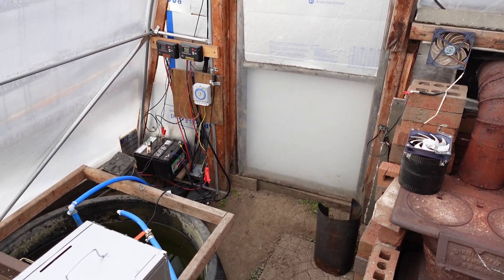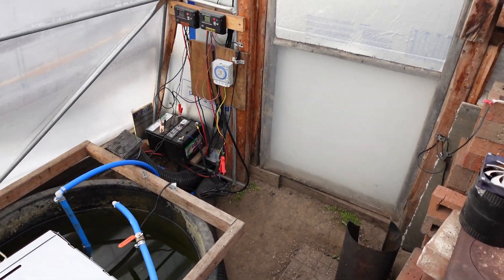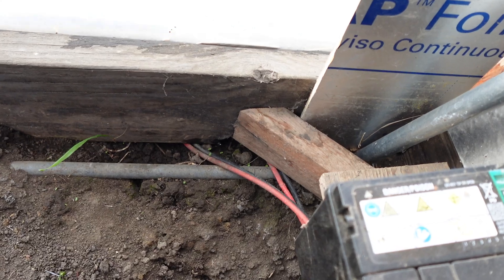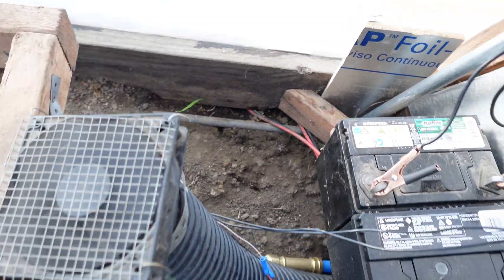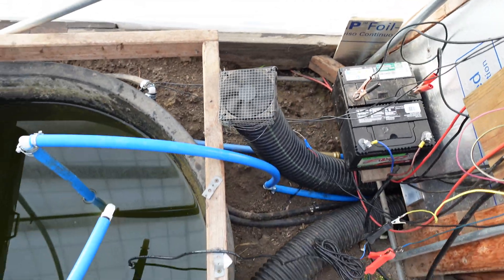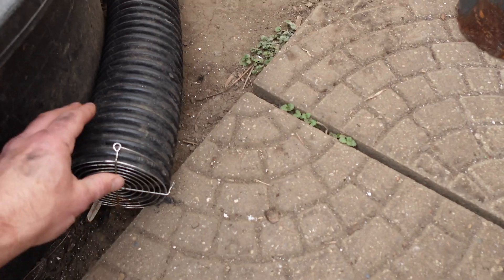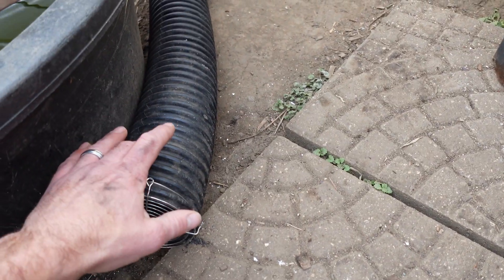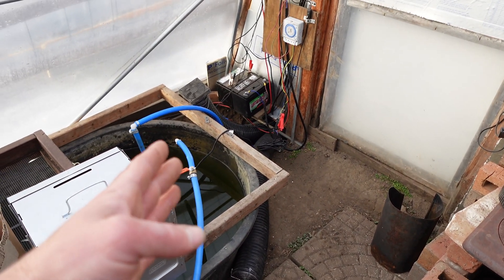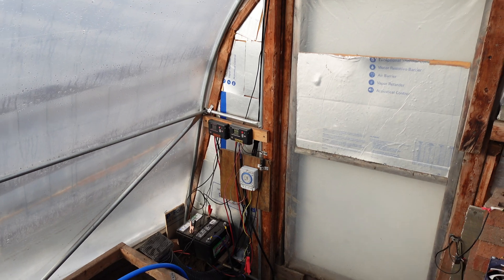Speak of the devil — here comes a little bit of sunlight. Not warm, but it's something. We've been operating our compost-heated system basically ever since we set up the greenhouse. Look at that — we've got some sprouts coming up, quite interesting. We've been using these little 12-volt powered fans in a simple setup. It's not pushing the full 88 cubic feet per minute because we've got friction and turbulence in the tubing, but we are pushing a decent amount of heat — about 85 degrees coming out, roughly 80-some degrees from our water, and the tank is sitting at about 70-72 degrees.